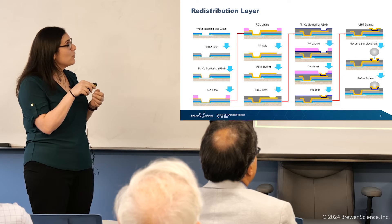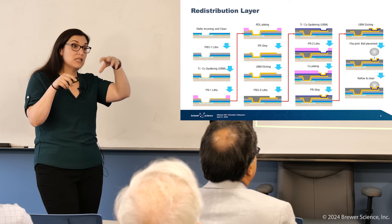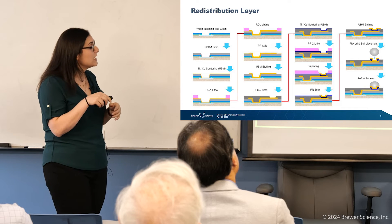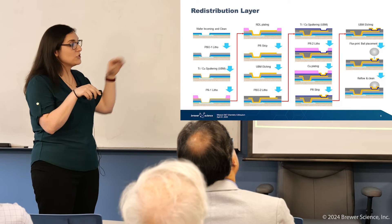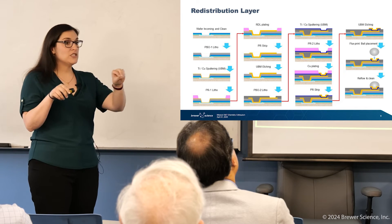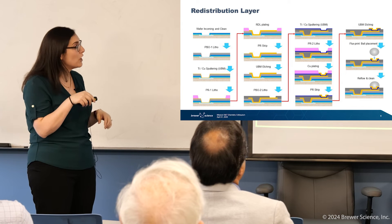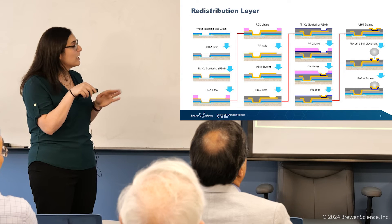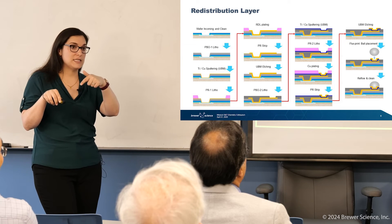If we walk through this, we have our incoming wafer with a landing pad. Oftentimes we need some type of dielectrics in order to insulate all of those interconnects. So we do a lot of spin-on dielectrics and patternable dielectrics — those are things we're working on right now at Brewer Science. Then you sputter your seed layer, which allows you to do your subsequent RDL plating. You have your copper seed, you do your plating to build up that copper line. Resist is used over and over to redirect that line exactly where you want it to go, so you can open up the space in the wafer where you want to put down your solder ball. When all is said and done, you have your landing pad, and then you can drop your solder ball right where it is. All we've done is rerouted from the landing pad on the left side, and now we make our interconnection on the right side — that's what the RDL does.